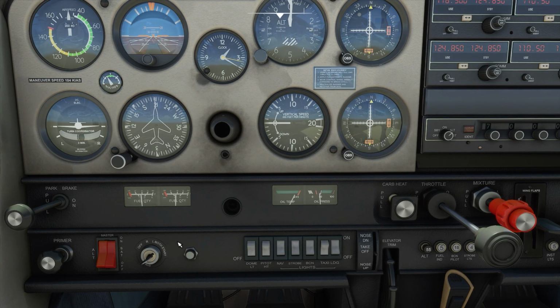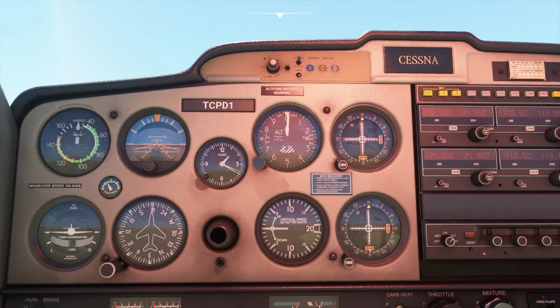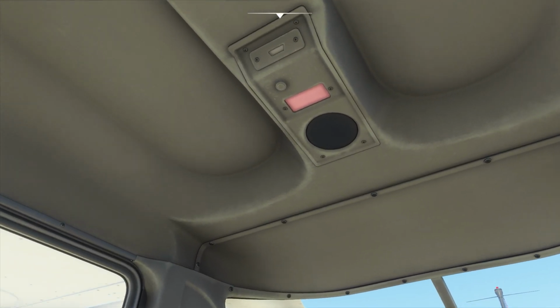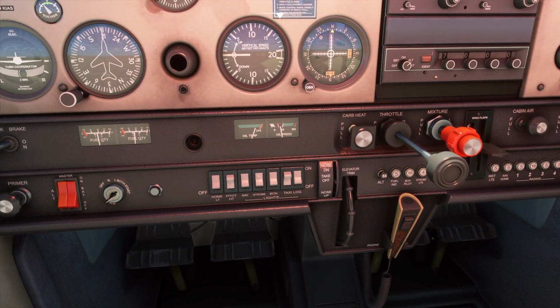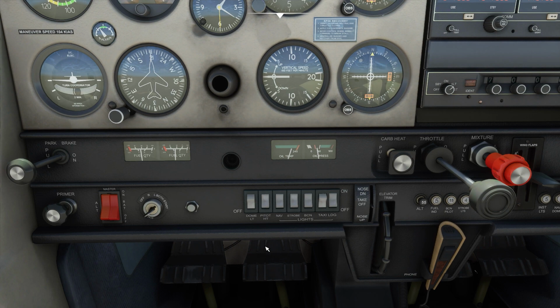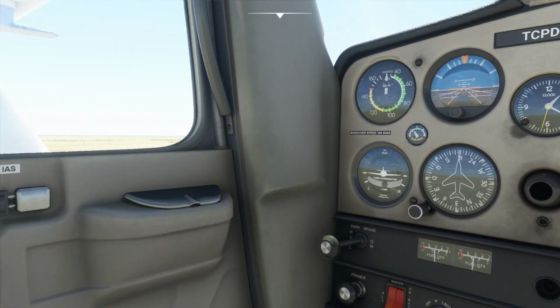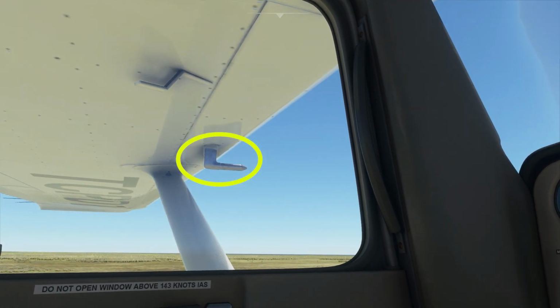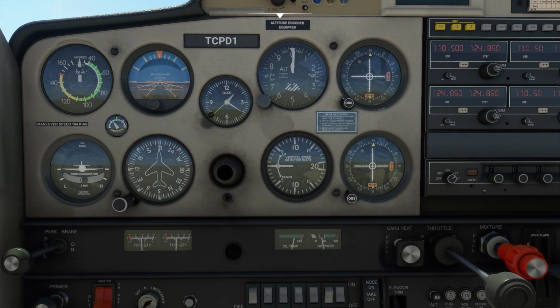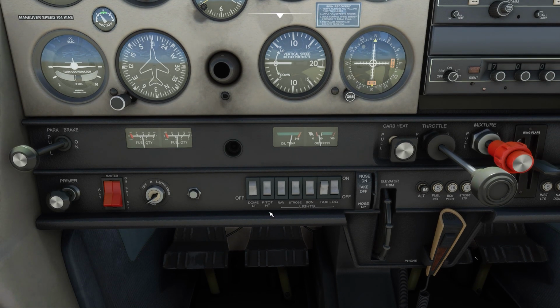Next we'll discuss this lower switch panel. We just press the dome light, that turns the red light on above our heads. Next is the Pitot Heat. That heats the pitot tube. That would be used in the event the pitot tube iced up, or we could use it as a preventative if we were flying in weather conducive to icing.